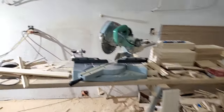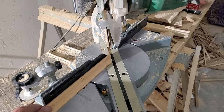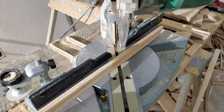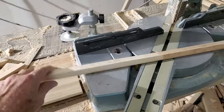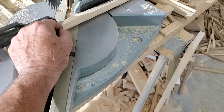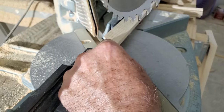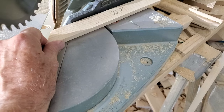And then when I'm cutting them on the saw, so I cut this miter here, and now I don't want to take and turn the saw this way. It's too time consuming. I just leave it in this position. So now I'm going to use this as my pattern piece, but I've got another pattern piece, so I'll line up the ends. I'll make a mark here, so now let's say this is the long uncut piece. I leave the saw in this position, so I just cut. Now I flip the molding over this way, and my mark is here. You want to hold it level. You don't want to tip it because it'll mess up your miter. But that just comes from experience doing it by eye. So I hold it here, and I cut.